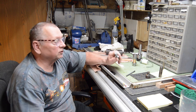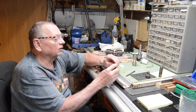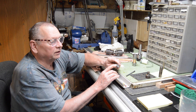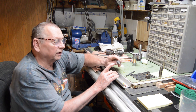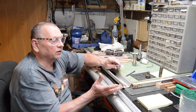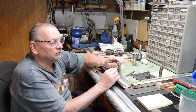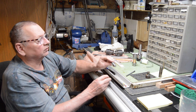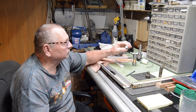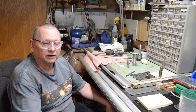Basically I'll put this back up and do this side first, because I won't be able to chuck on the threads. I'll take a finishing cut, get it to 0.625, set it up in the mill, touch off with the indicator on the carriage, come in 42 thousandths, and I'll have a way to index this six times to cut the hex. Anyway, that'll be next. Thank you for watching and I hope you enjoy these videos.